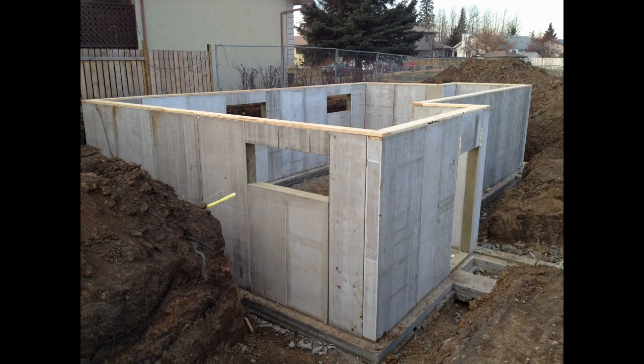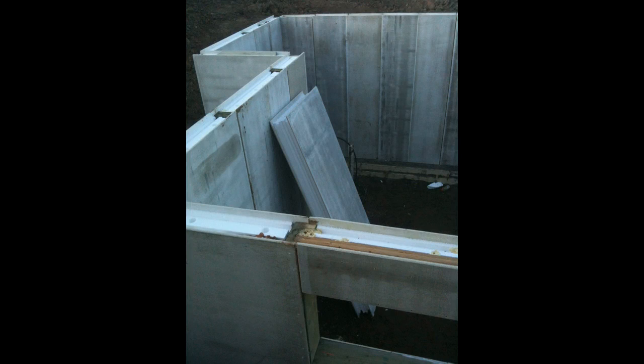In this picture you can see my foundation — the panels are standing there, there is a sill plate sitting on top, and it had to be drilled out in the locations where wires are to be run. This picture shows the holes in the panels. All the wiring is done from up above in my basement — wiring was run in basically the ceiling, then down each panel to a plug or switch, then back up and over where it had to go.